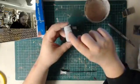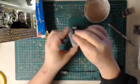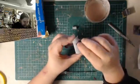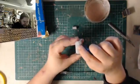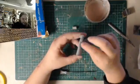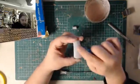There's a couple of scratches here from sanding. That could have been improved a bit, but since that's going to be a flat, not gloss surface, it's not going to be noticeable later, especially in a dark color. Polish it a bit to hide it further, and then the painting stage will pretty much eliminate that, so that's not too much of a problem at all. If I was going for gloss, that would have to be sanded from a coarser grit down to a finer grit, not just the polishing that I'm doing now. There we go.